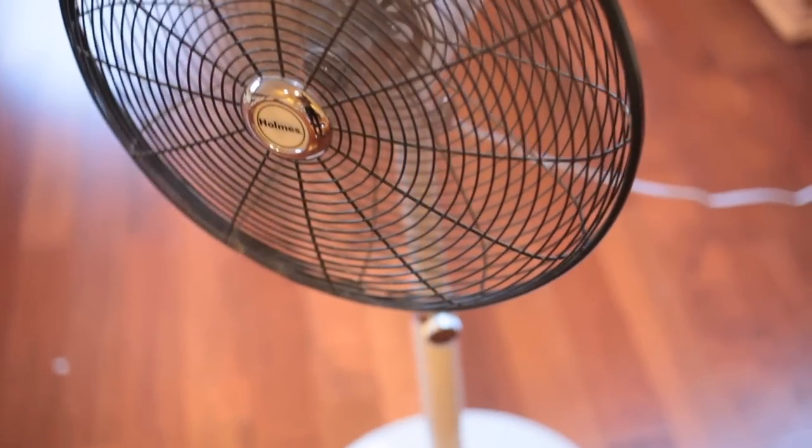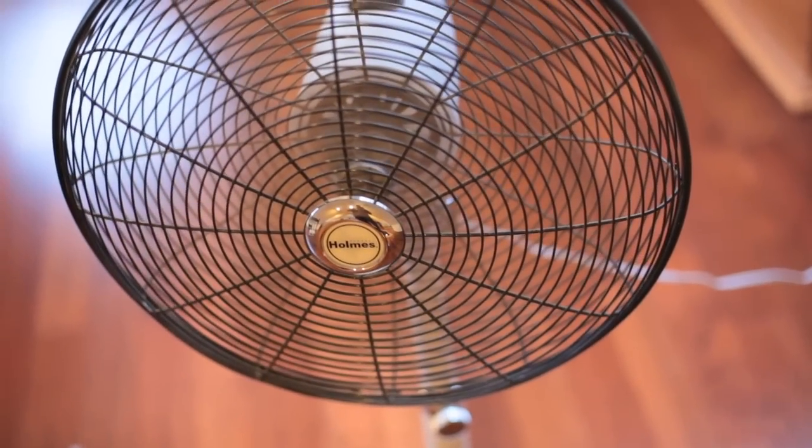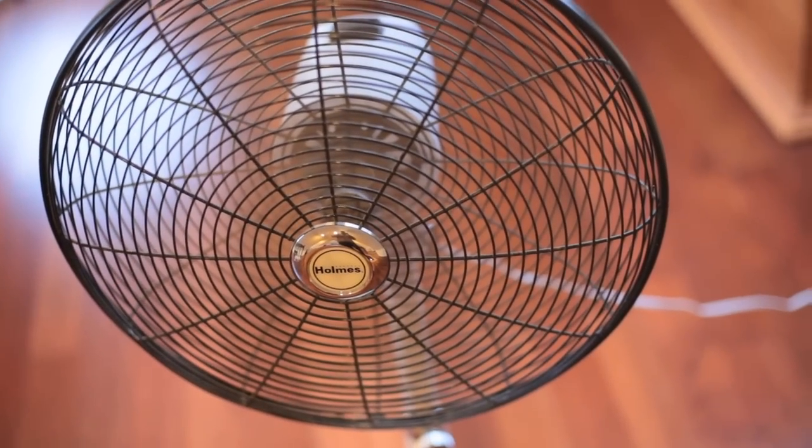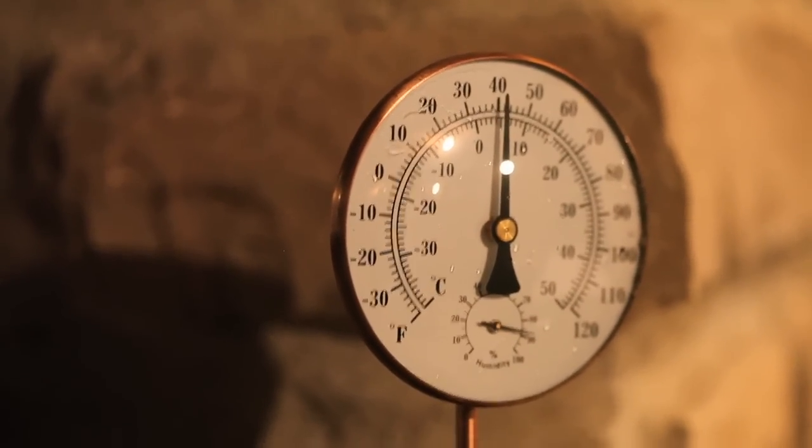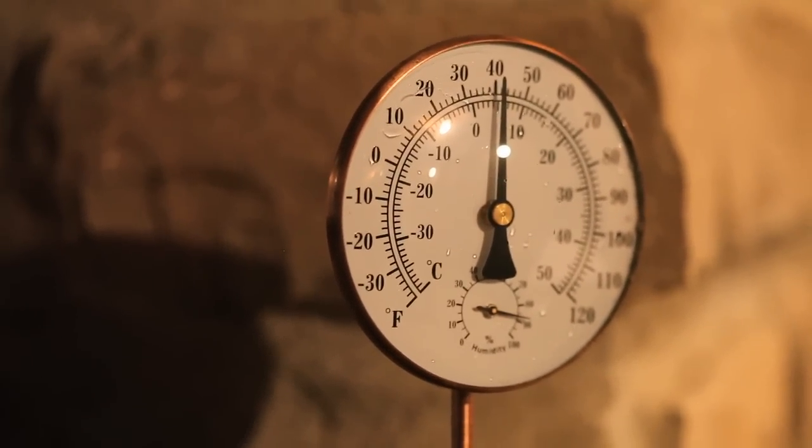Step number 4, dry the area. Drying out chronically moldy locations is crucial for success, and air circulation, heat, and a dehumidifier are the 3 most powerful drying tools you've got. You'll get best results if you monitor the relative humidity of the space with a hygrometer, allowing more or less outside ventilation to speed drying depending on the outdoor temperature and humidity conditions.